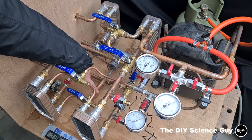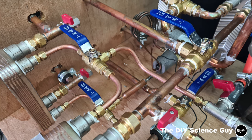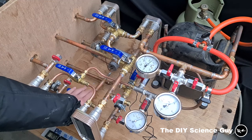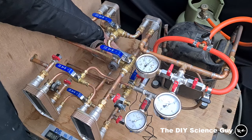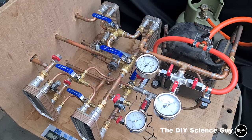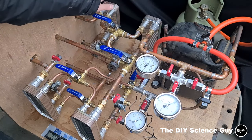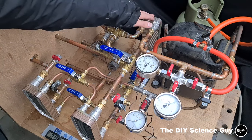The liquid propane is then pushed through the filter dryer and through the capillary tube. This capillary tube creates a resistance which in turn creates a pressure difference, so the pressure is high on one side and low on the other. When the liquid propane comes out of the capillary tube it enters the low pressure side and has room to expand, but it needs heat to do that. At this point the propane is 80% liquid and 20% gas, and it removes heat from the water or antifreeze that flows through one of these heat exchangers which act as evaporators.